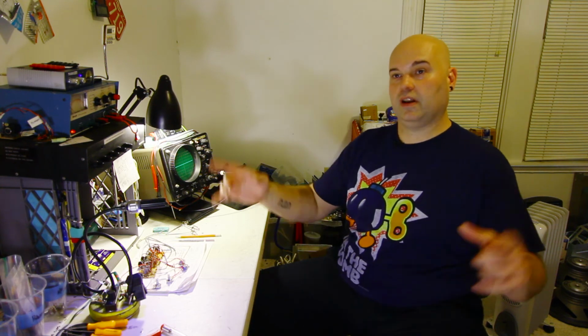And there are voltage regulators that are going into this circuitry to regulate that voltage so that it doesn't go over a limit. And there will be 2 external power connections for accessories. Those accessory connections have a thermal circuit breaker attached. So there's protection there. It's protection for the battery, it's protection for the wiring inside the device, and it's protection for the devices that are connected to it.